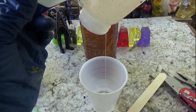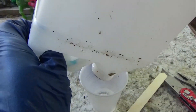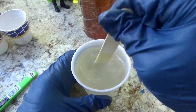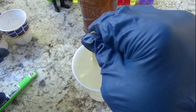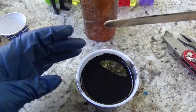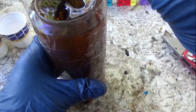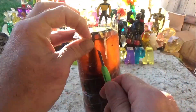Here's the resin — down to the last drop on that one. We didn't have any in that one, or just a little bit. I think it was cold so the resin's a little sluggish. I added some more from new bottles. Resin seems to work pretty good mixing different brands. But I don't mix different kinds of resin together if I don't have to. Anyways, there was that black dye made by Composimold — it is fantastic. It also makes the resin a little more viscous or liquidy, and it'll get in all the nooks and crannies a little better.